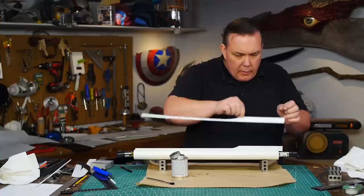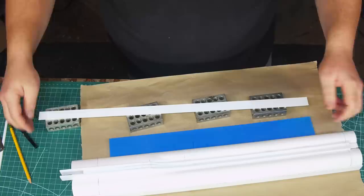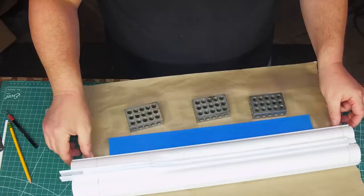And then I glue on the flat center rail and add the two sides. This is all Sintra plastic — it's a foamed PVC sheet and it uses the same glue as PVC pipe. There are a couple of side rails. To glue them on I use some blue foam for support and then my 1-2-3 blocks to keep them square.